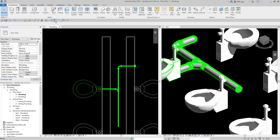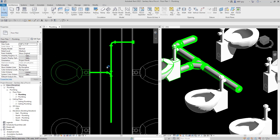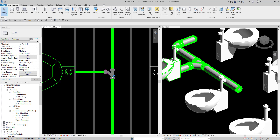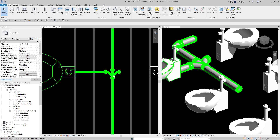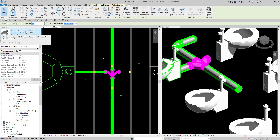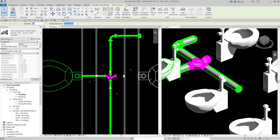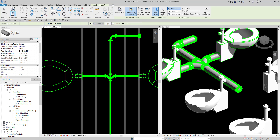I'm going to turn the thick lines command on so you guys can see this a little better. Now that I have this little combination fitting, I can click on it and click this plus button and it'll create a double type fitting. If I click on this, you can see it's called a Y combination with eighth bend double. From that fitting, I can right click on this piece, draw a pipe, and draw it right into this water closet just like that.